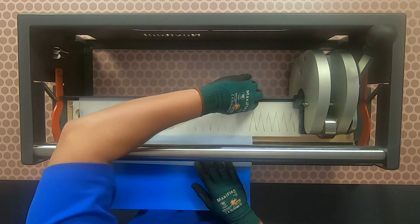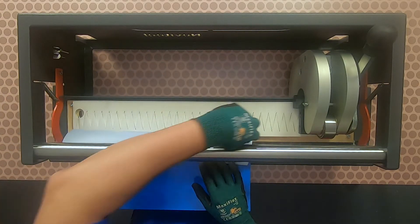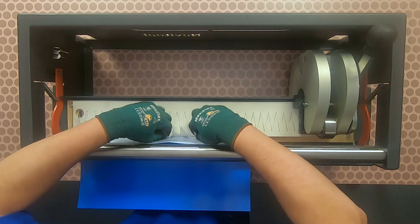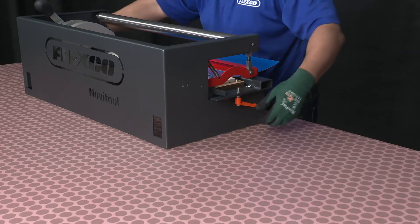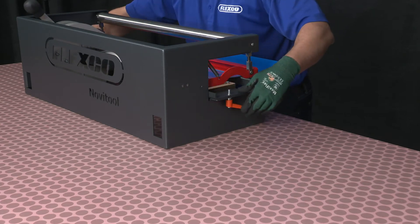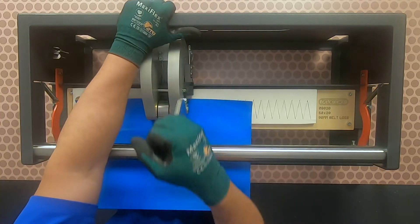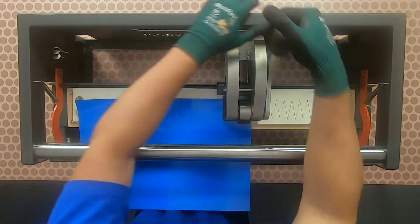Once completed, keep the belt clamped and remove the belt waste and loosen the fingers from the punch board prior to unlocking the belt support tray and sliding it to the back most position and locking in place. Lay the top cover over the already punched fingers and repeat the punching process again, starting in the middle of the belt.